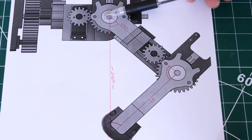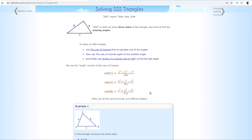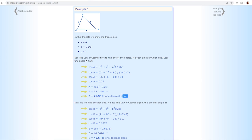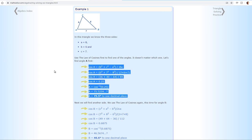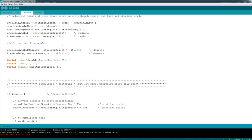All we need to do is some trigonometry to solve one angle, and we know all three lengths of the triangle — this is pretty much high school mathematics. I'm using the website mathsisfun.com to solve this because I can't remember how to do it, even though I did it for Open Dog. This is the page for solving SSS triangles, where we know all three sides and want to work out the angles. We need to solve one angle using a bit of Pythagoras theorem and then trigonometry. Here it is in code — I've gone through each stage with a different variable so I can check it.